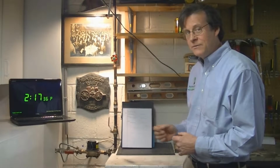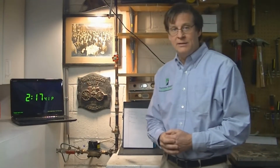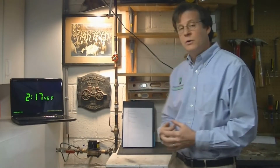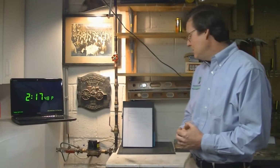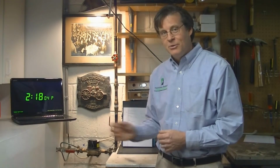Hi, we're back. And our second test for 15 minutes yielded a 92.75 gallon run rate. Same 15 minutes before, 112.9 gallons. That's a 17.8% reduction from that meter spin with the same two faucets open for the same 15 minutes. So as you can see, the oscillation movement in this valve will reduce meter spin. And in a second, I'll let you come on up here and take a look at the new meter reading.